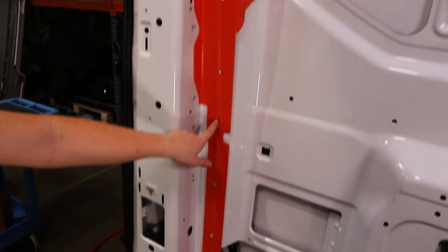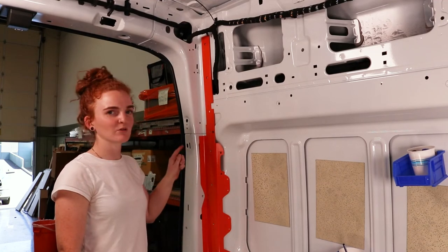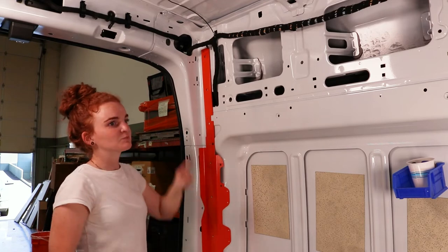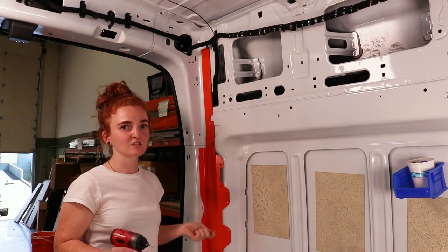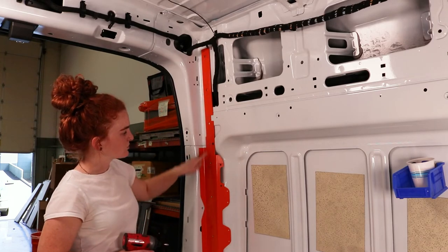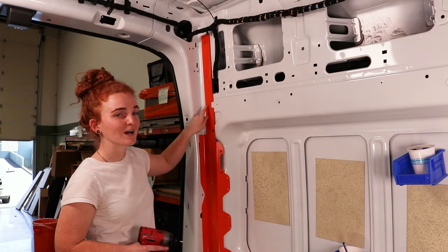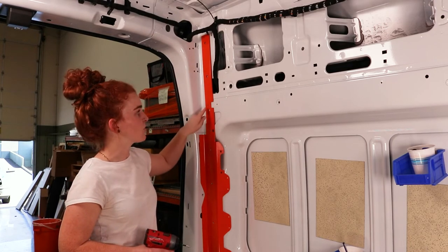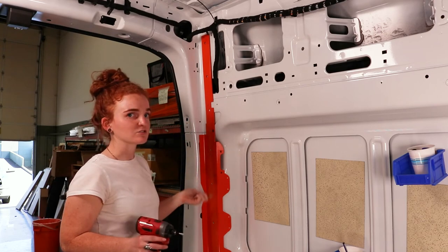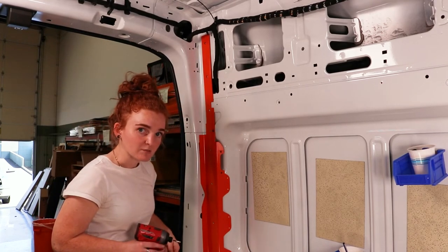I'm going to set one here, one here, and then one down here by my index point. I want to point out that all these pre-drilled holes throughout the A-frame mean you could put your whole A-frame up before drilling any holes or setting any rib nuts, to make sure everything is aligned really well. Just make sure you take all the set screws out afterward — you can see the larger rib nut holes going in a straight line where your track bolts in; any holes in line with that or where the track would overlap, you don't want a set screw or rivet sticking up there. They all come out at the end.